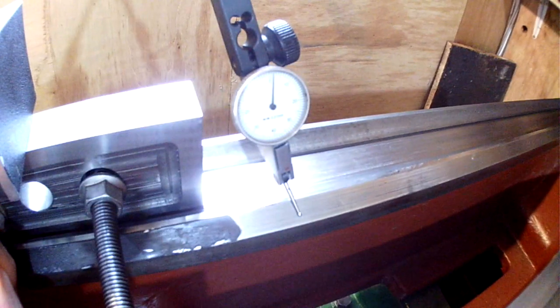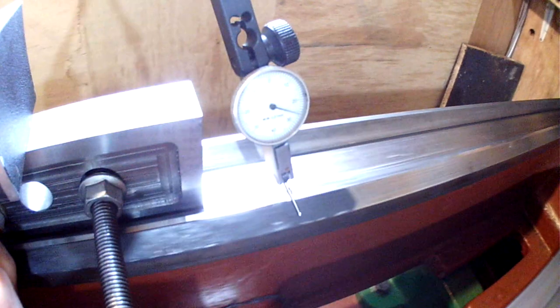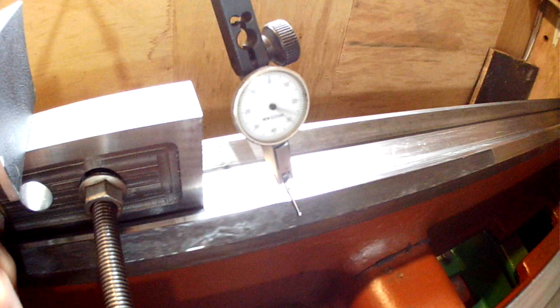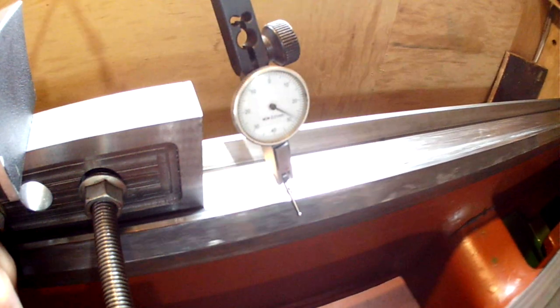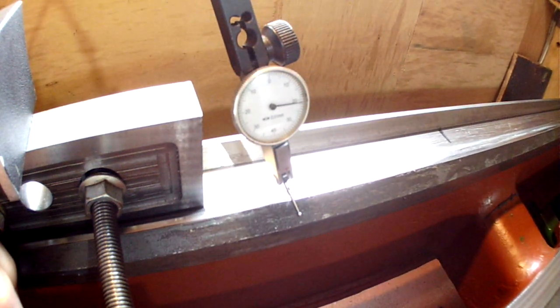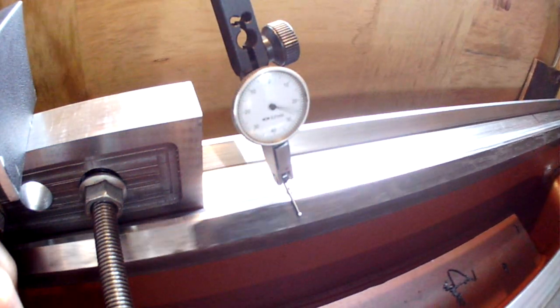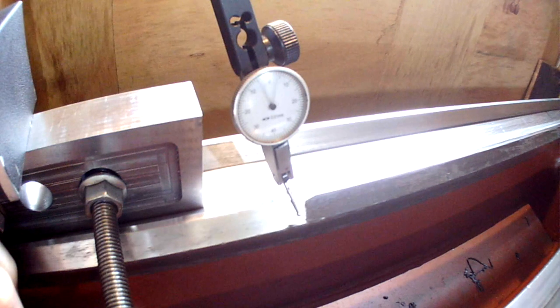Shaving the excess resin off the important surfaces at this moment in time was a good call, because after a good 24 hours it really was set, and the resin had built up to about 0.2 to 0.3 millimetres, that's about 8 to 12 thou above, and that's good. Now that I've done one, I felt more confident about what I needed to do to get the other two slides fixed.